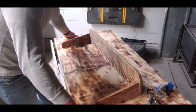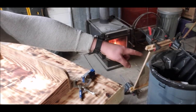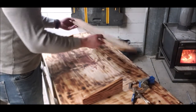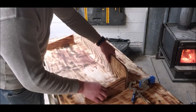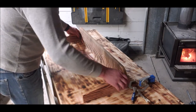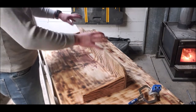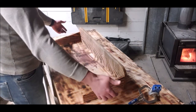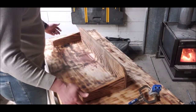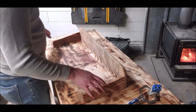So now what I'm going to do — I got this all mocked up. We'll have to cut that piece drying in front of the fire. I got the top done, the sides are going to go on. What I'll do is just pocket all these in, then we're going to do a bunch of wipe-on poly. Whenever I get that completed it'll slide right up in here — we'll glue it in and put some nice brad nails around from the outside to hold everything. Glue will dry nice and strong. I'll wait until we get it in to poly it.